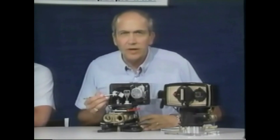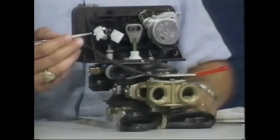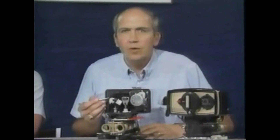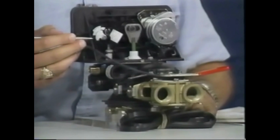If we wanted to change this, we have to be very careful in the case of demand regeneration systems, because when you cut a salt setting you're really reducing the capacity of that unit in terms of recoverable capacity. We generally never want to reduce a salt setting on any type of demand system, because the meter is programmed for the number of grains of capacity based on the original volume of resin and the original salt setting the manufacturer put on the unit. If we cut that salt setting we'll come up with some volume less than 24,000 grains, and conversely if you arbitrarily increase the salt setting the unit's going to regenerate as though it only had 24,000 grains — we'll be wasting salt and the homeowner won't be happy.